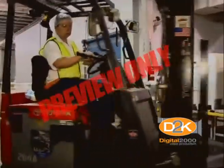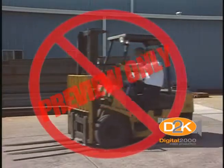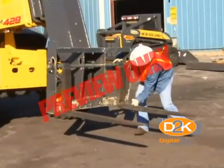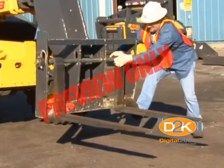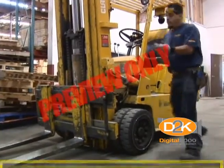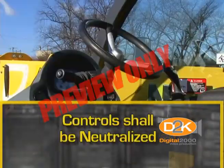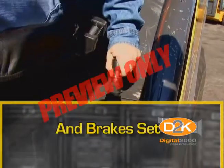Generally, this rule applies to the person operating the vehicle. There are virtually no places for an additional person on the vehicle. The employer shall prohibit arms or legs from being placed between the uprights of the mast or outside the running lines of the truck. When a powered industrial truck is left unattended, load engaging means shall be fully lowered, controls shall be neutralized, power shall be shut off, and brakes set.